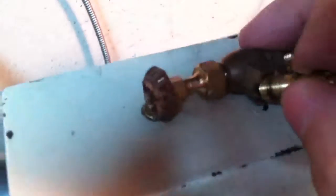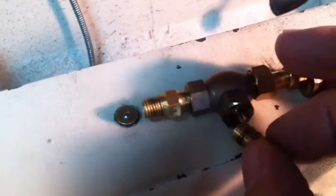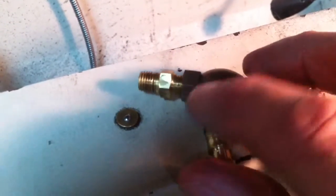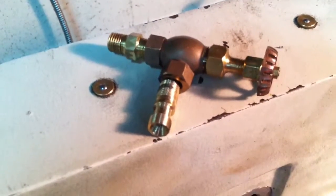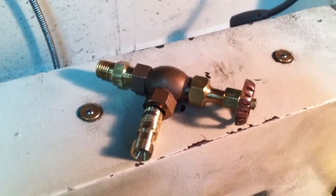So one more part made, and I hope that explanation is interesting and helpful. This part will go in there as an adapter for the 3/16th inch copper tube that I'll be making next. Next I need to make some of the male fittings and the nuts that hold them on over the tubing. I'll be silver soldering a bunch of stuff when I get a chance, and I will keep you posted. Thanks for watching — I hope this is useful to you.